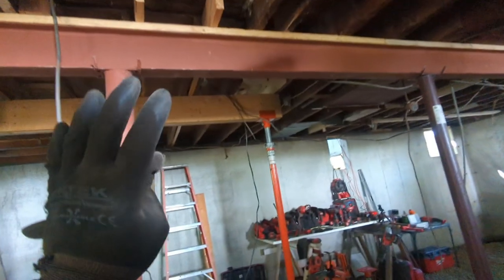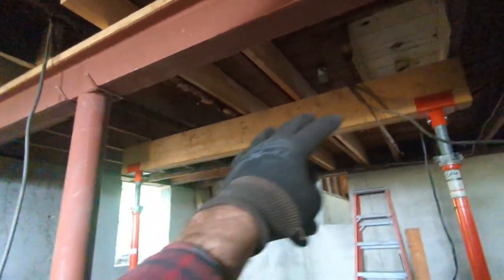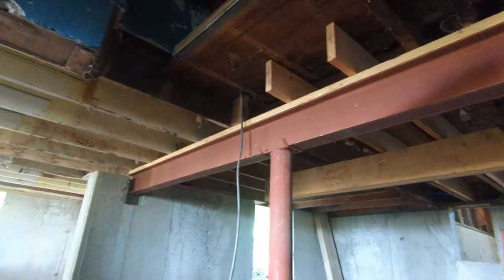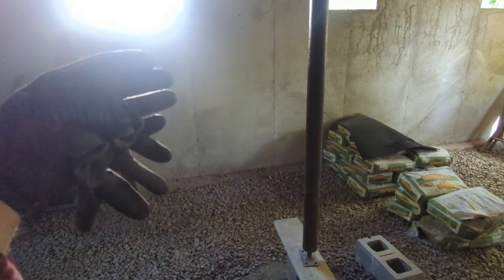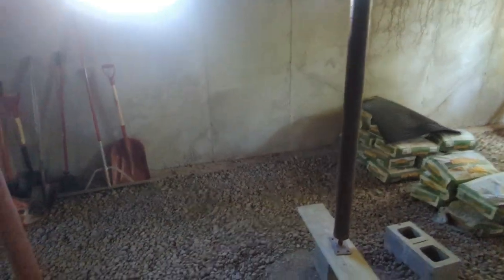So before I shoot all this up with nails and proceed to take this down, move it over here onto this side, and start working over here, I want to know where I've got to be with the ends of these. So I hung a plumb bob off the landing, got a sense of where it was on the floor here, and a distance from there to the foundation wall, which of course is going to come toward us over 4 inches, because we have to have insulation and framing and whatever. So I have a certain distance here. Then you look at what you've got.